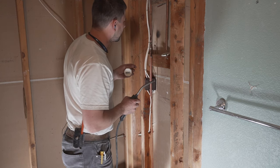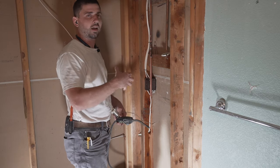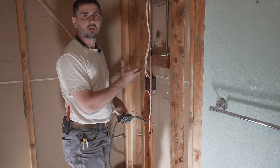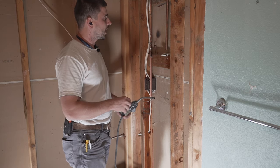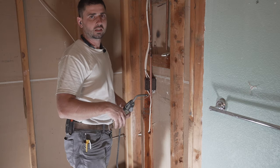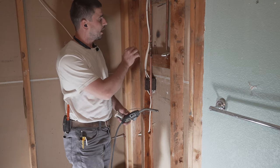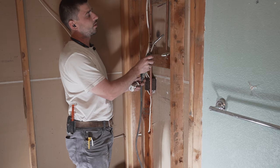Get it really good. And I try not to take a wet rag and get it cold right away, because that's going to give it a stress, right? Everything that's hot is expanded. When it gets cold, it contracts. So sometimes, in some obscure, really off-the-wall case, it can crack the solder, so don't do that. Now let's get this pipe ready.